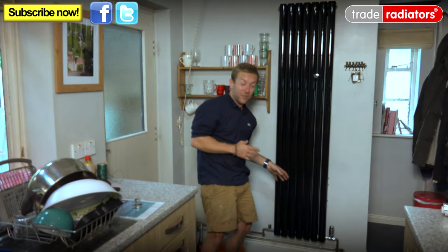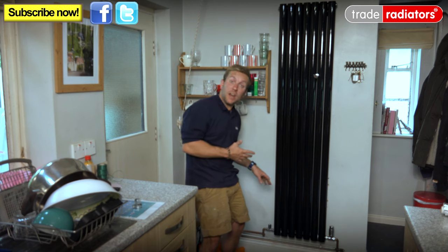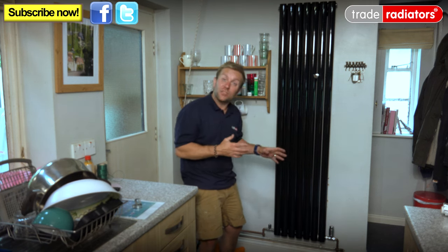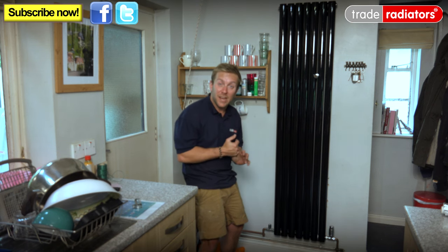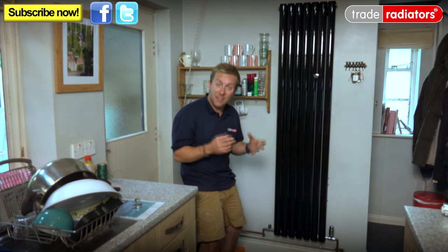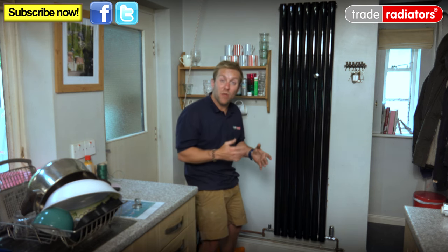You'll know if you haven't done that properly because often you'll just have this vein gets warm, then this vein gets warm, or alternatively the water just shoots across the bottom and back out the radiator, and the top takes absolutely ages to get hot. You'll also find that radiator manufacturers have different ways of diverting the water — sometimes it's already built in and you can't push a flap down, sometimes you have to put a small rubber bung insert in as well. I cannot stress how important it is to have a quick look at your instructions before you continue, to make sure which way the flow should come in.